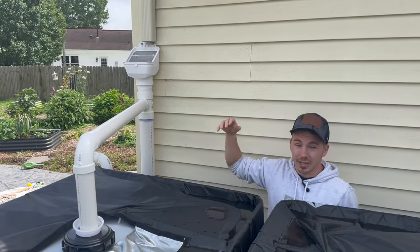What happens here is the water initially flows from this filter into what is called the first flush, or a sediment trap. All of the debris that's on the roof — you don't want it to go inside your IBC totes because it'll contaminate the water. This long tube here is three inch PVC which ties into this filter, all sealed up with PVC cement. Basically, the first amount of rainfall is most likely going to be the water that flushes all the debris off the roof. All of that falls into this tube, and this tube has to completely fill up before any of the water flows over into the IBC totes. This should catch most of the debris.